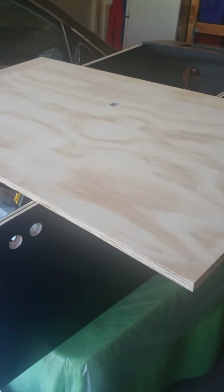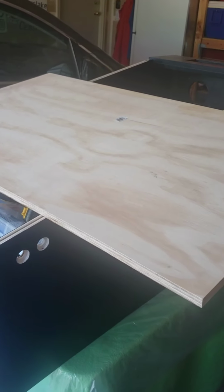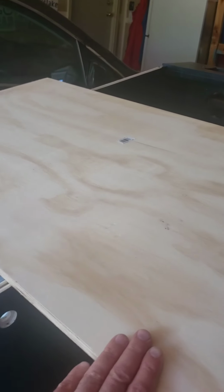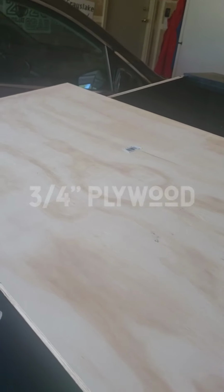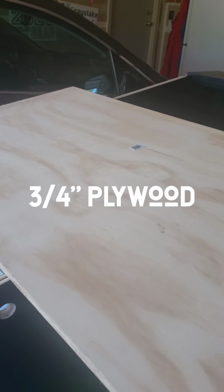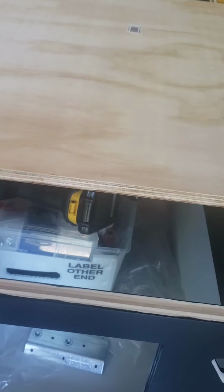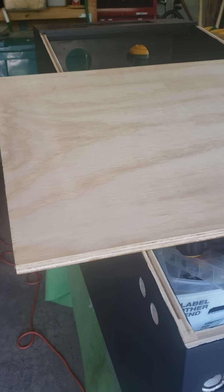The next task is mounting the main playfield, or the main monitor, inside the cabinet. To do that, we mount the TV on a piece of plywood. It's cut with various notches and guides to allow for the plunger and the flipper, so it won't bump into them. It's going to be mounted the same way as traditional pinball, which is on brackets.